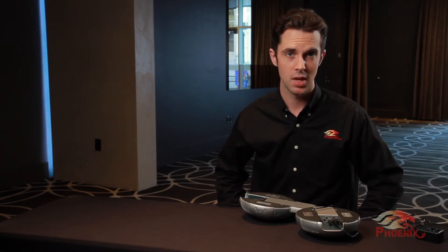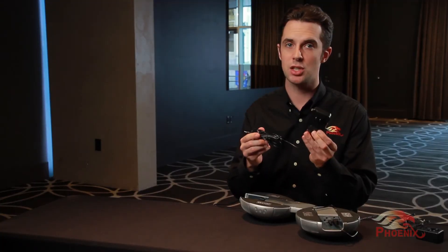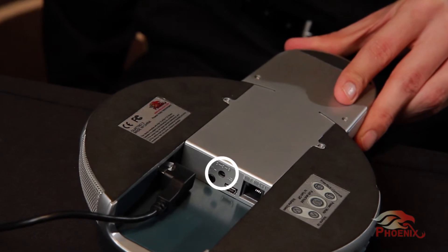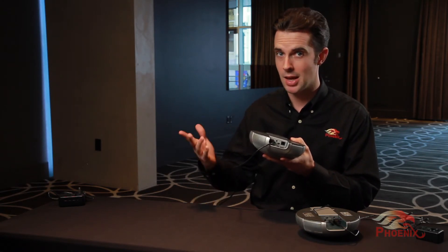How do we use the central power scheme? This option requires that you have a Phoenix Audio 48-volt power adapter. All the units participating in the chain also need to have an interface card to support it. If your Quattro has any communication interface like the telephone or smartphone, it already supports this option. If it does not, it has to have a power chain card called the 304. If you look at your Quattro connectors, you should be able to locate a small DC connector between the USB and the 3.5 millimeter connector. If your unit does not have such a connector, it does not support the power chain option. If it does, then you're good to go.